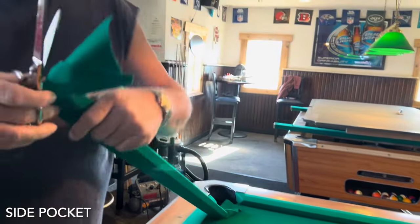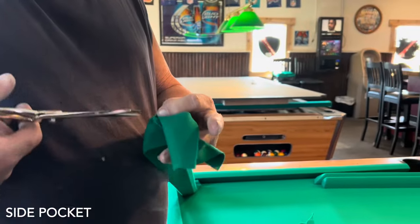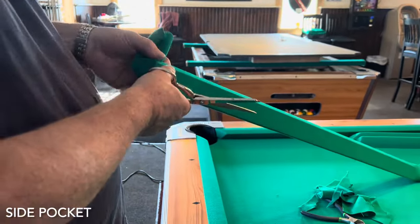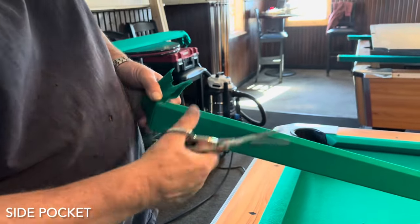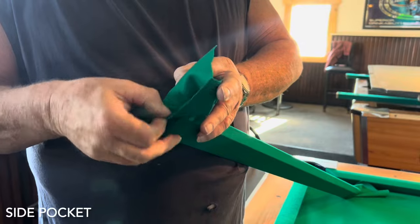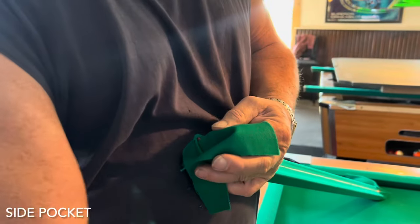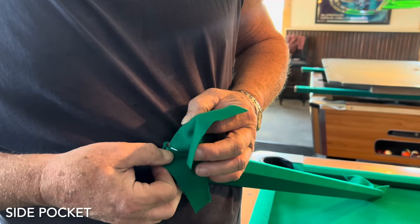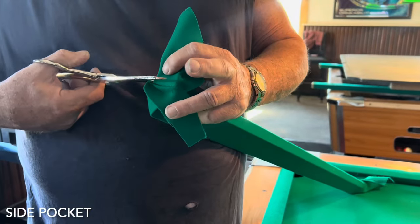You take your scissors, cut this, your overlap out. See this? Cut it out. Now, you come down here at the bottom to here, and you cut this out. Now, when you take and you fold this down, pull this fold here tight. Then, put a staple at the top, right in there. That holds it nice and tight, so that this fold never comes loose.